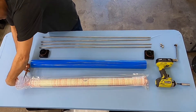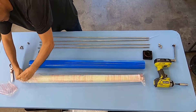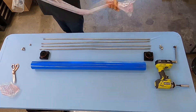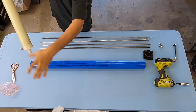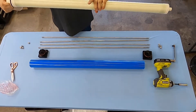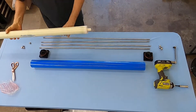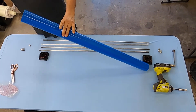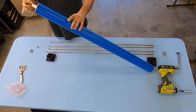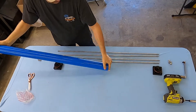We're going to start with opening up the membrane. Caps come out. Notice one side of the membrane has an o-ring, the other one doesn't. It's not really an o-ring — it's a hydraulic seal, but we'll just call it o-ring. Pick a side; it doesn't matter which side. Just remember which side has the o-ring, because this is going to be the input side.